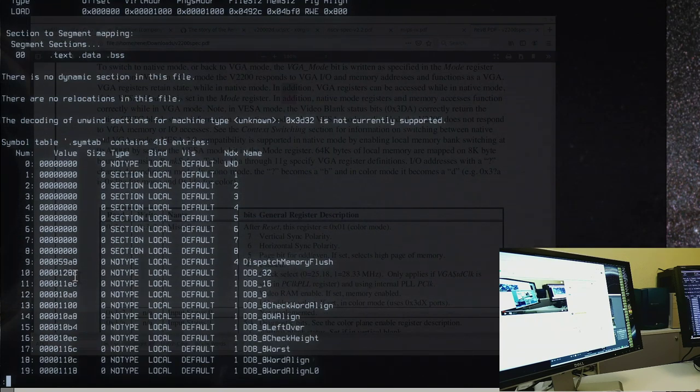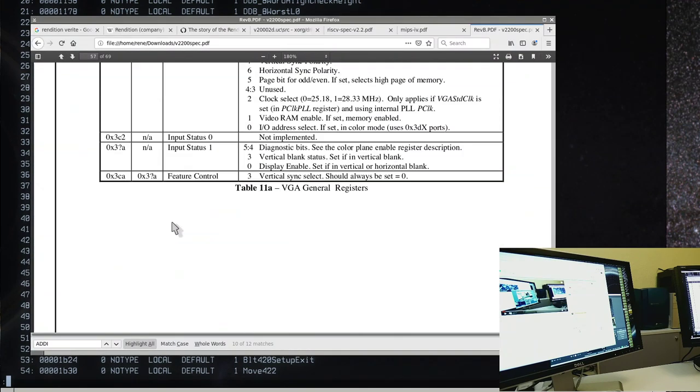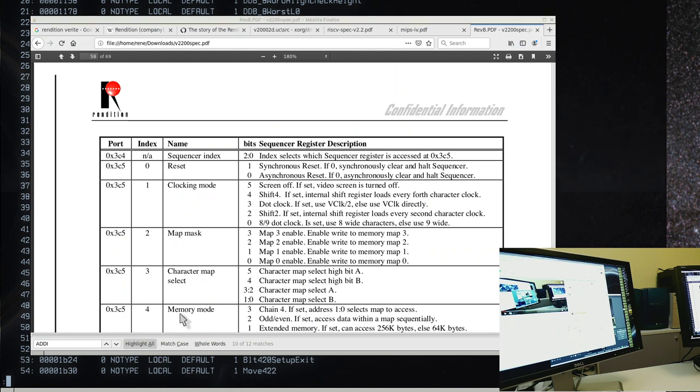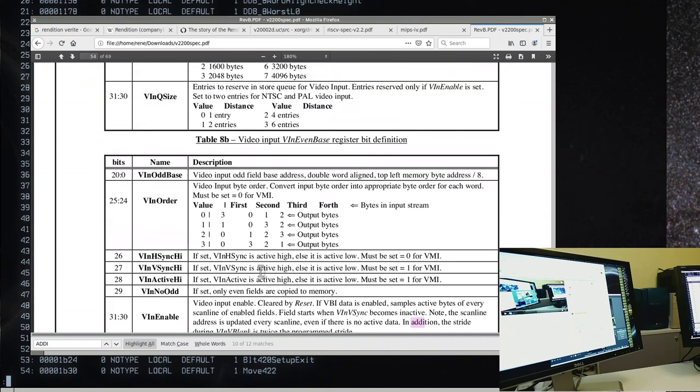And this is really cool, because remember, this is firmware from like 1997, 1998, or they maybe started to develop it in 1996 or somewhere around this time frame. And 20 years later, you have really nice symbol listings. Take that, NVIDIA. This is how it should be done, because if someone is doing vintage retro stuff with an NVIDIA card, or if they want today to write a driver for the latest and greatest NVIDIA silicon, yeah, no specification, have fun reverse engineering this. And you see how much fun it is reverse engineering all those magic numbers for the opcodes. So of course we see a lot here, but we do not see everything, because readelf and objdump and GCC and binutils do not have support for this Rendition Verite, because this is of course their very proprietary instruction encoding.